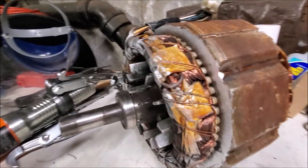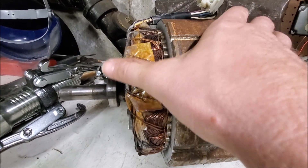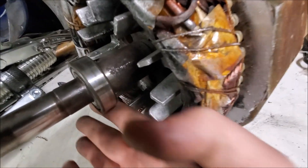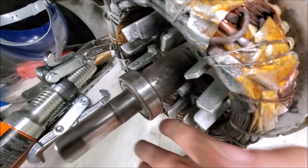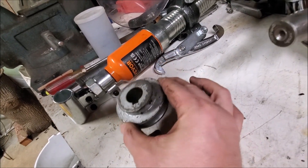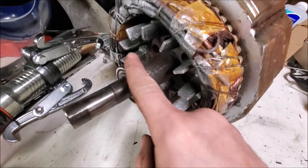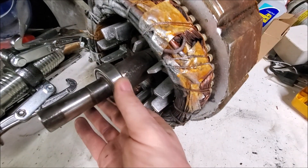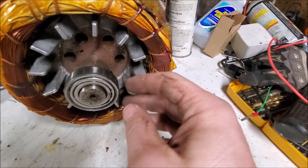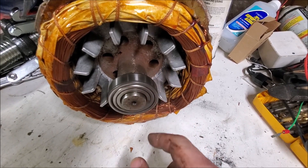I took the covers off and you can see a large armature with all the copper in here. This is a six and a half horsepower motor so it's fairly powerful. Look at this bearing — it hardly wants to move at all. In order to get the cover off I had to remove this pulley. See this bearing doesn't want to move at all, so it would make a humming noise. And this one has another bearing in the back — it's not great but it still spins a little bit better than the one in the front, which is completely shot.